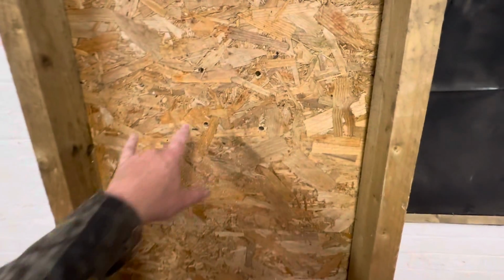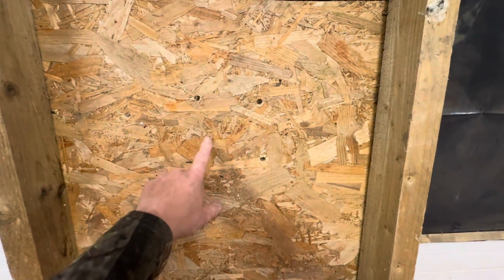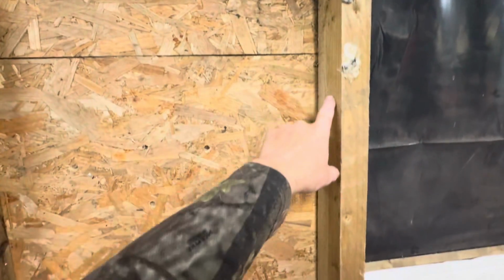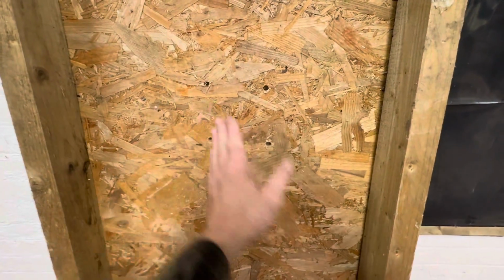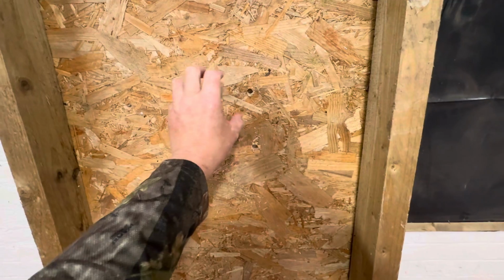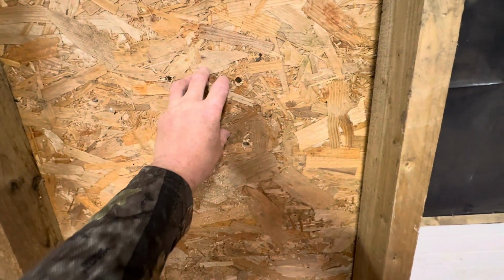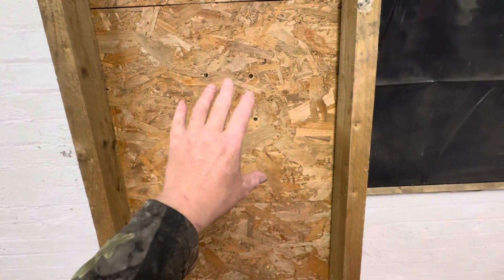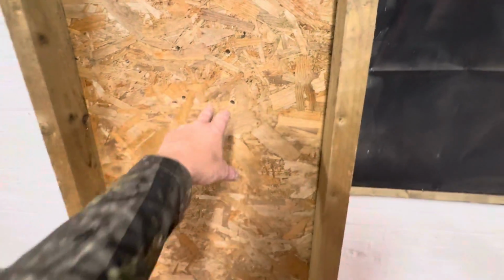First, we're going to cut a hole in here. Size doesn't matter. The reason we're cutting a hole is that we're going to line this with damp-proof membrane, basically plastic sheet, and funnel the sheet down through that hole so this can drain. We can hose fine pea gravel through and keep it really clean if we need to. The water's not going to sit on here. It's going to go through the plug hole, down the keyhole or whatever.